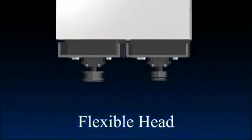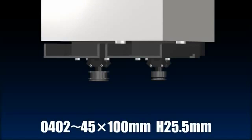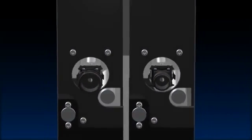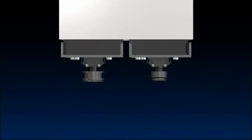A third such innovative variation is a flexible head that handles a vast range of odd shaped components. It is ideal for handling components from 0402 on up to 45 by 100 millimeters and component heights up to 25.5 millimeters. This flexible head is capable of load control to a maximum of 50N. Attaching a gripper nozzle gives the expanded versatility needed to handle a vast range of custom components.